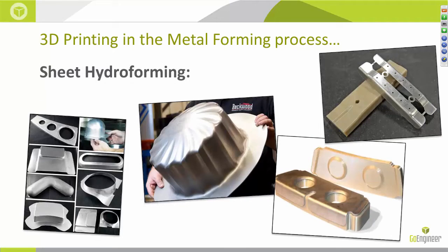We'll start with sheet hydroforming. Sheet hydroforming is a cost-effective way of shaping ductile metals such as aluminum, brass, low alloy steels, or stainless steel into lightweight, structurally stiff, strong pieces. In sheet hydroforming there are generally two denominations: hydroforming in a traditional sense, where the fluid contacts the sheet of metal, and bladder forming — sometimes called flex forming — where there is a bladder that contains a non-compressible fluid but no fluid actually contacts the sheet.